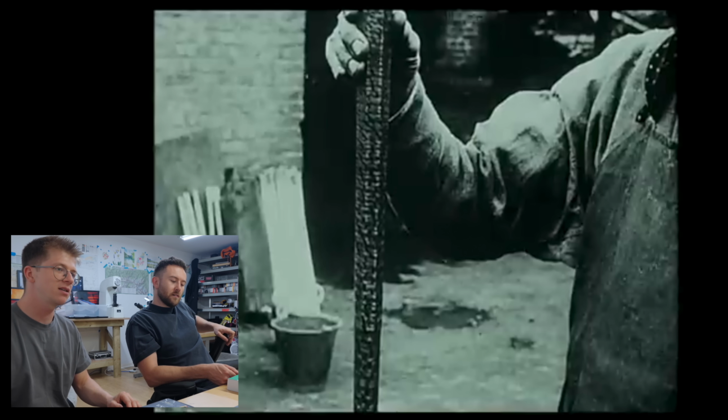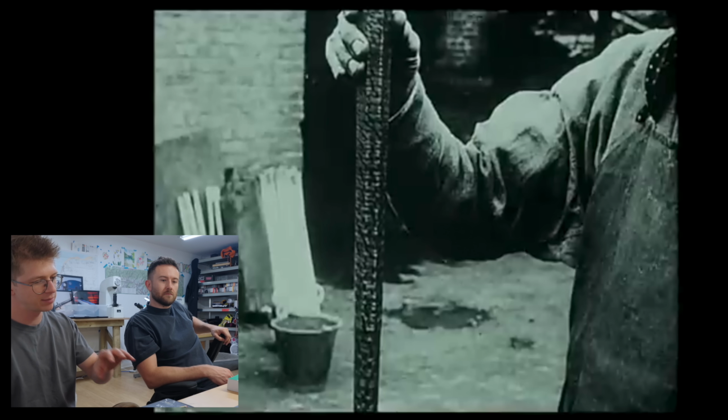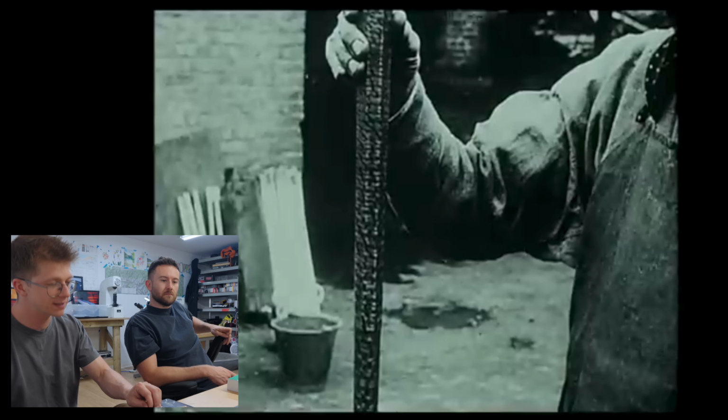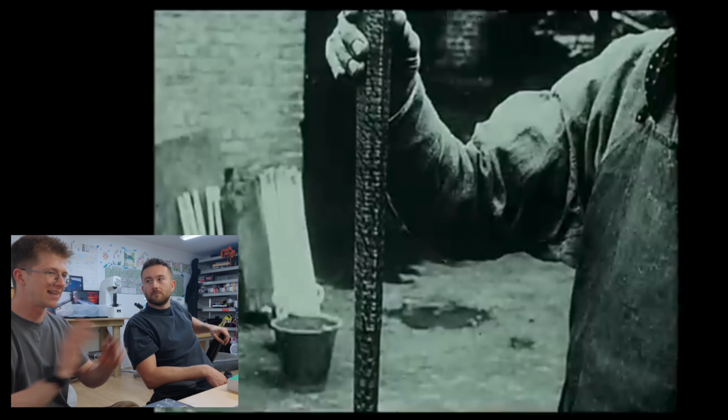So how do they get the pattern? Well, I was going to say, would that give them a less vibrant pattern? Well, see, that's what I think. Because if we put mild steel with 1080, there is some contrast and some difference, but it's quite subtle. So what's interesting to me is without the benefit of an alloying component like nickel, they're still able to get strong contrast, despite the fact that the carbon diffuses through the whole thing and ends up being quite a consistent kind of carbon percentage.